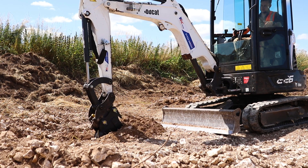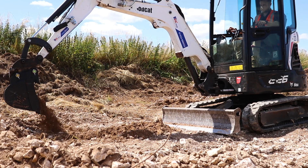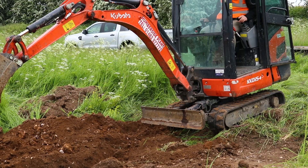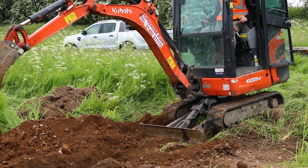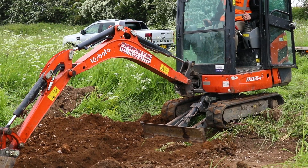Number one is to provide stability when digging or grading. The most important use for the dozer blade is to provide support and additional stability when digging. The dozer blade can be positioned at the front or the back of the excavator depending on where you're digging, and this extra horizontal support against the ground reduces the amount of rocking incurred while digging.